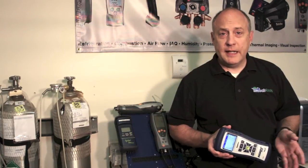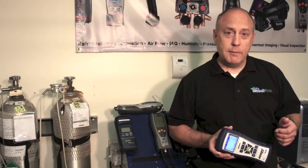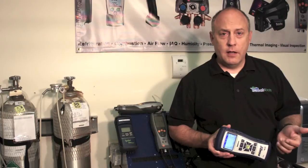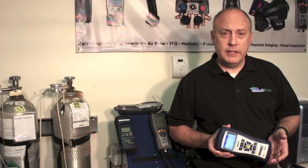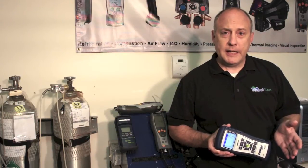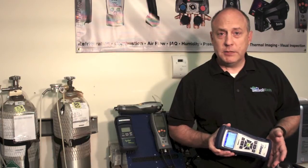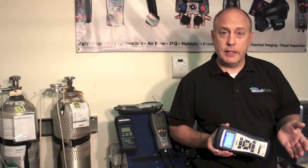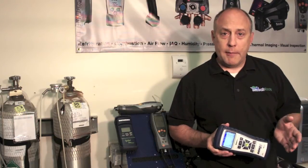To put it quite simply, a lot of these analyzers go through hell. We're putting them through hot, wet flue gas that contains acid and all kinds of byproducts of combustion. And while the analyzer is designed to be protected against those things, it does put some wear and tear on the analyzer and we have to periodically make sure that it's still operating correctly.